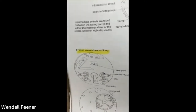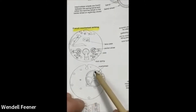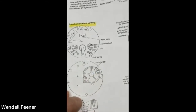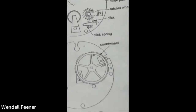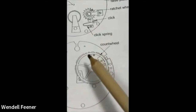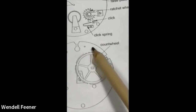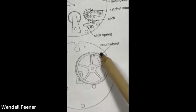If we compare that to the French movement, the French has what they call a count wheel with 12 little notches in it. You can see one, two, three — and the space between is the hill, just like in the American movement. There's an arm that runs along so it can't fall into the hole to stop it when it's going through the hill.